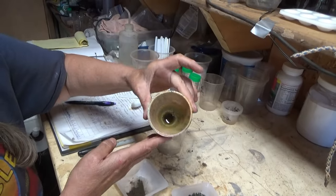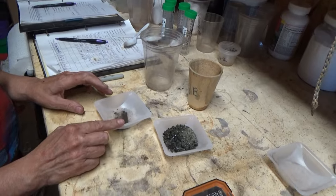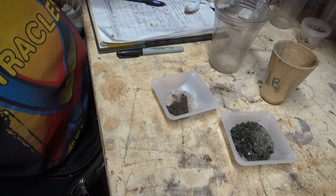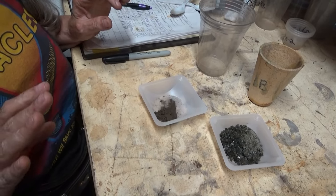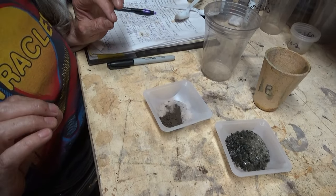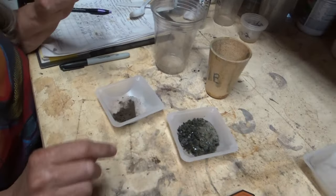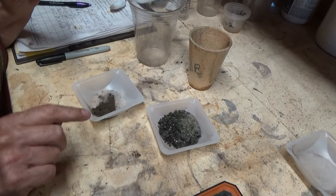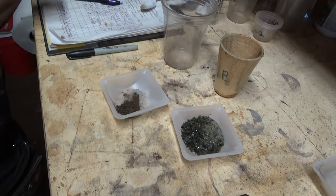So like any good scientist, I saved everything. This is the slag that was used in that particular bead that had an unusual result. This is the same crucible that the original sample was done in. We also have some random electrolytic debris not tied to anything. What I'm going to do is mix it up with extra charcoal, a little bit of litharge, and re-smelt this so that any precious metals trapped in that slag can come out.